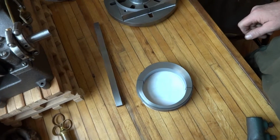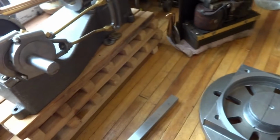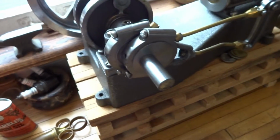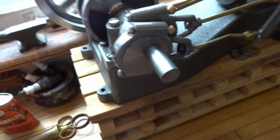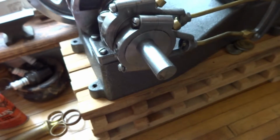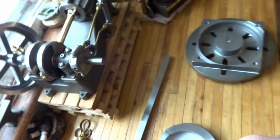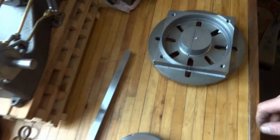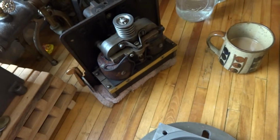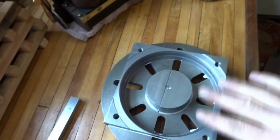And what basically this does, move the camera around without jiggling it, kind of like on this little steam engine. It's the eccentric. Reciprocating motion there. And it's going to run the magneto for the ignition on the mill engine. And it only needs to move a little bit.